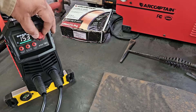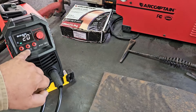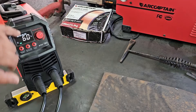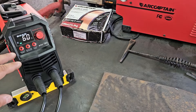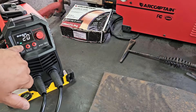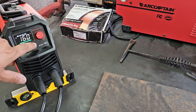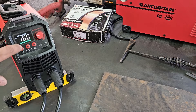We are running on 220 volts and all the way down to 20 amps. If you press electrode selection, that is not available in this menu. Your function mode - that right there is your arc force, you can go up to 60. Your hot start, same thing, goes all the way to 60. That's pretty much it for MMA. Now you've got TIG up here, same thing, goes up to 160 amps. Hot start is not available for TIG.